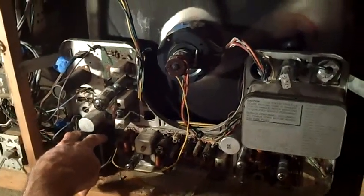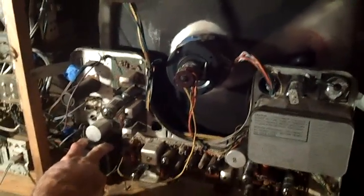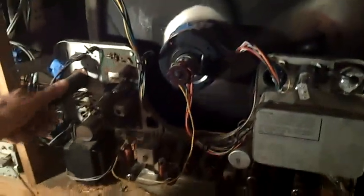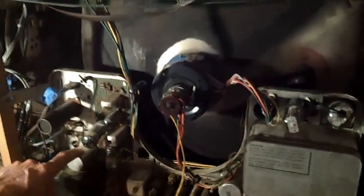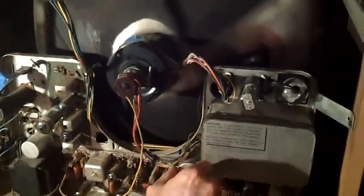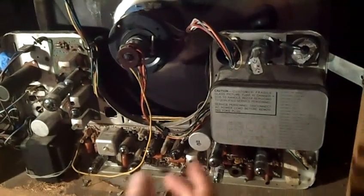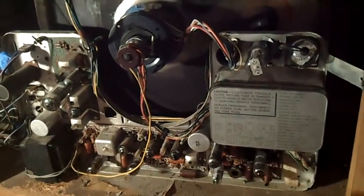It uses a voltage doubler — this is what these two little diodes are about. The voltage doubler doubles the output from the transformer for the B+. It's got one of the doubler capacitors right there that I replaced — this capacitor went bad, so I just cut it off and stuck a modern-day capacitor in its place. I don't remember the exact deal with the other metal can capacitors; I think maybe one section was bad and I replaced it below the chassis.